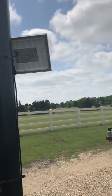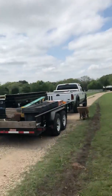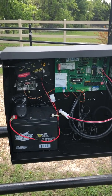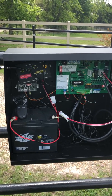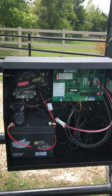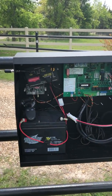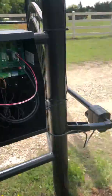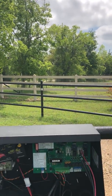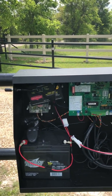We have our solar panel installed in a southwestern direction, so all afternoon we have open sun. For this particular battery here in Texas, we should get enough sun hours to complete the cycle we need every day. Once again, that's a US Automatic Patriot Solar One — operated with the US Automatic battery-operated keypad, US Automatic LCR remote receiver, a car sense three-wire probe, and an EMX photo eye for inside and outside protection on this particular job. Thank you for watching our video.